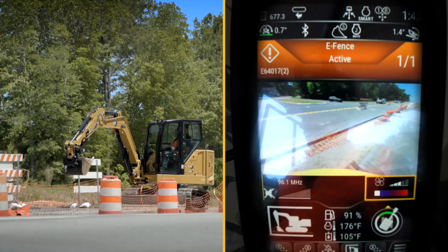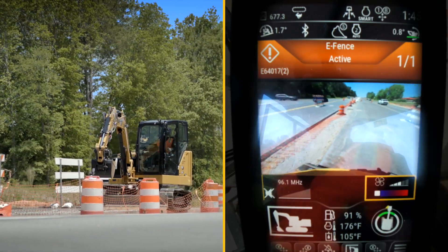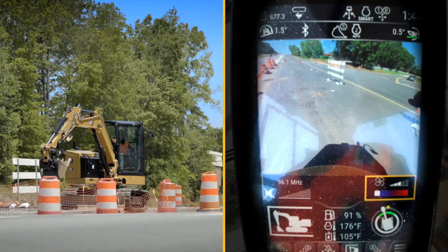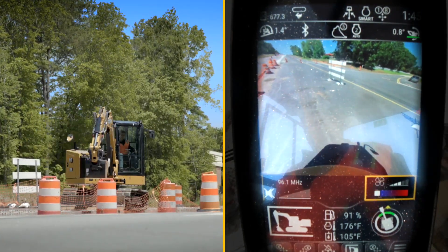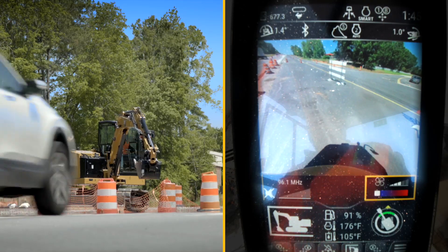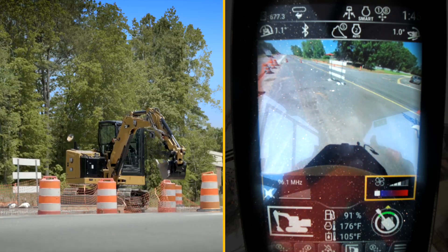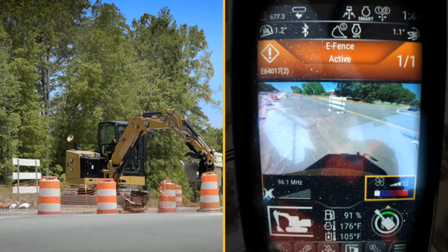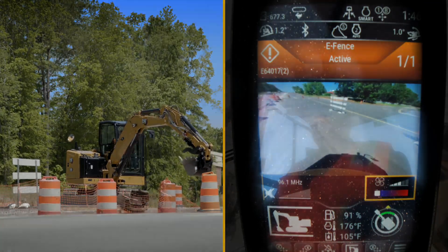As for the right hand side, I'll swap over to the other side. So instead of swinging with the house, I'll swing with the boom swing to the left hand side. And once again, you will see that it's perfectly protected. It's going to slow it up and stop it from going past my protection zone right there — I can't get any further.